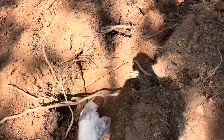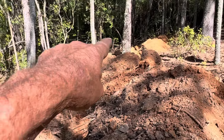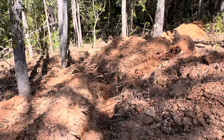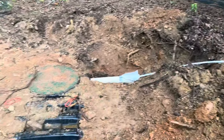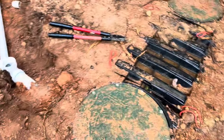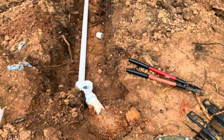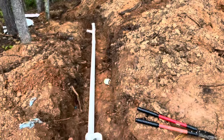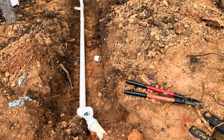I'll show you putting the drain field in and hooking it up, how it all goes. Here we are right below the tiny house. The sewer line coming in isn't done yet. This is the septic tank — that's the end of the tank, this is the out, it's a little bit lower where the holes are. Got a grommet, four-inch pipe comes out, we got a clean-out right there, and then a long-radius 90 that goes down to the next one. Every bend will have a clean-out so that if it ever gets clogged, you can get into it.